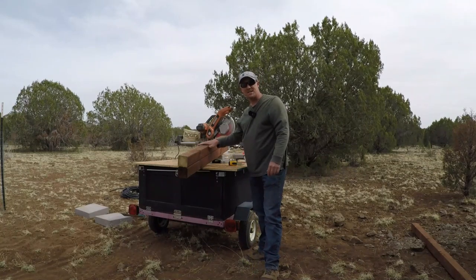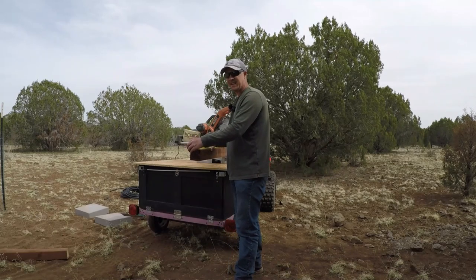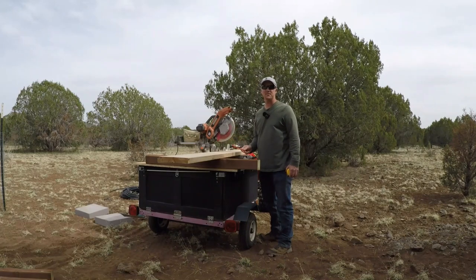There's one side - you're going to do that twice. A good example: this board right here is eight feet and one-half inch long - a little extra - while the last one was just under eight feet. So you want to make sure you have a good solid measurement for all four posts. Now going to cut two pieces of two-by-ten at 37 inches long.